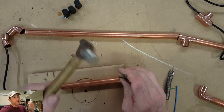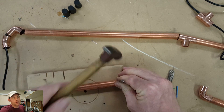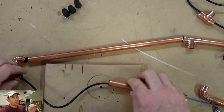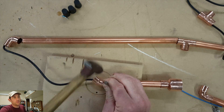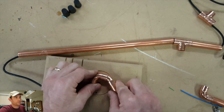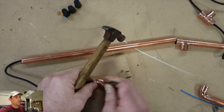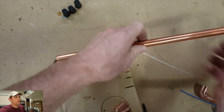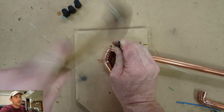Now this is what you do in lieu of soldering the pipe fittings together — you really wouldn't want to do that with the wire inside there anyway. So basically you just take a center punch, not a nail set. A center punch is harder steel with a sharp point, and you just run little divots in those fittings and it'll pinch them shut. It works very well. I've made a few displays for craft shows for jewelry using this method, just connecting all the fittings together with the punch.